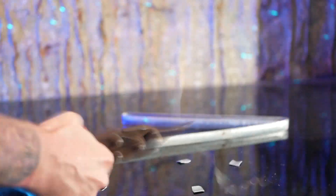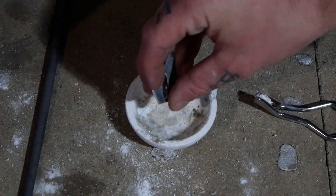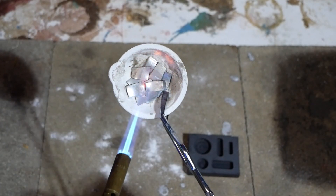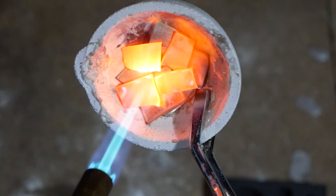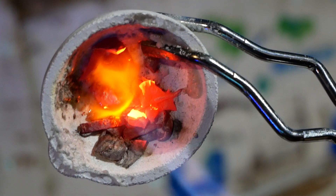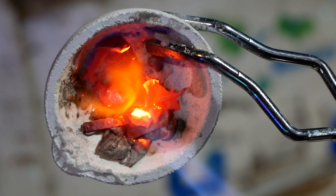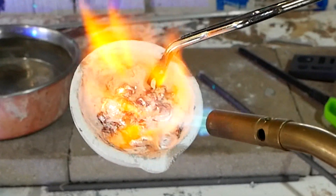While the crucible cooled I cut up some scrap aluminum, and after I got a decent pile I poured it into the crucible and lit my torch. Typically you'd want a higher temperature torch with mixed oxygen or something, but we're going to go for it anyway. With my baby torch it took a while for the metal to turn molten, but it slowly got more and more red and then began to turn to liquid aluminum.